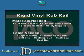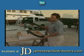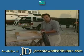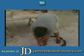Before we install this 20-foot length of rigid vinyl, I want to let you know that they come coiled in a box. We'll get into a little bit of a safety issue here — when we cut the cellophane, these strips could pop. The best thing to do would be to stand in between it and cut your straps so you won't get whipped with it.